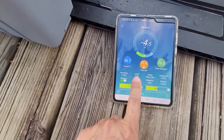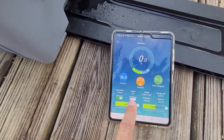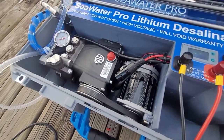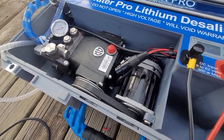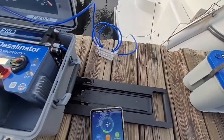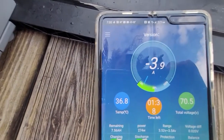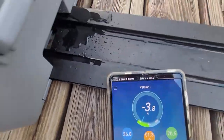We can turn off the unit from here. We can turn off the charging — if the unit was charging right now, I can turn it on and off. If for some reason I want to stop charging, I can turn it back on just by pressing here. There's a slow start. As you can see, this is the boost pump pressure. We have programmed the motor to start slowly to give the boost pump enough time to prime. So we are drawing right now 300 watts, which is 3.8 amps at 70 volts. The amps change as the battery changes in voltage.